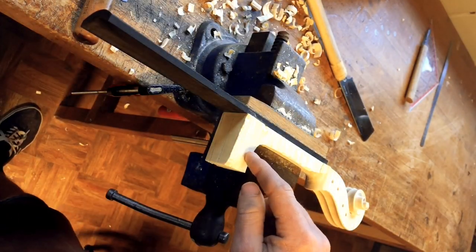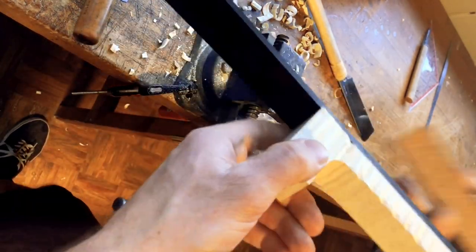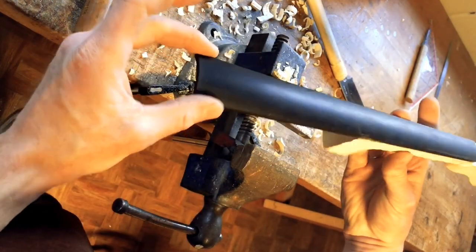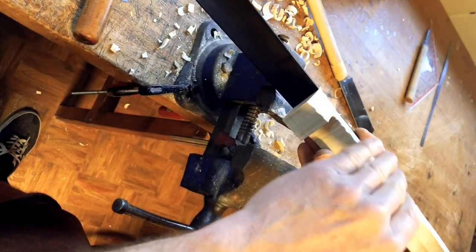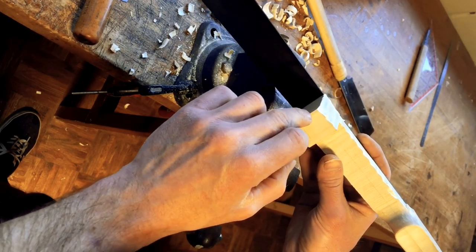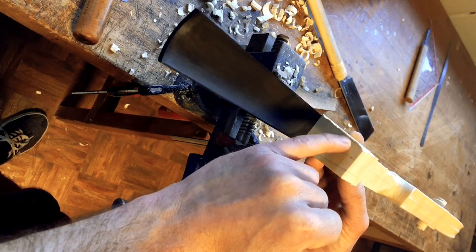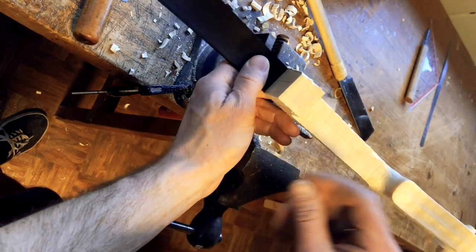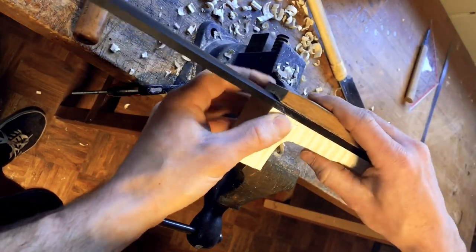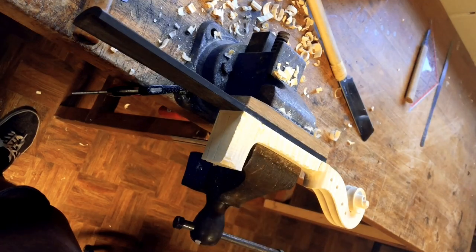Very important now, when you start planing this surface, we want to make a dovetail connection. So we have our fingerboard, which is running from small to bigger, of course, then our heel itself also runs in this direction. So actually the top here will be smaller than the bottom there. That's also the reason why I did 1 millimeter more when I was making the measurements there. I took 22.5 instead of 21.5, because here it will run smaller towards the top. So, for protection. And now I can start planing this.